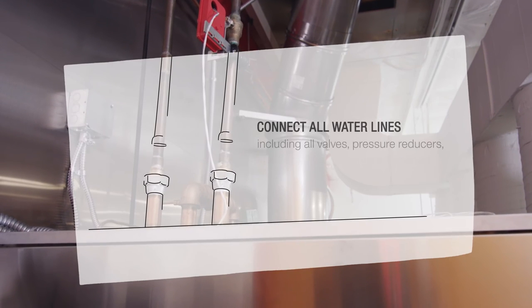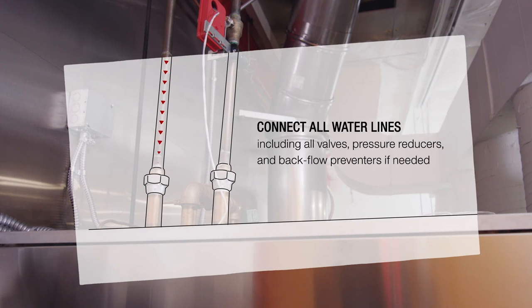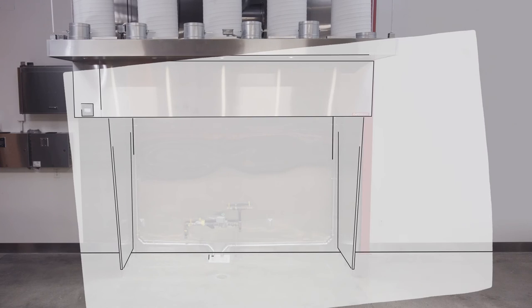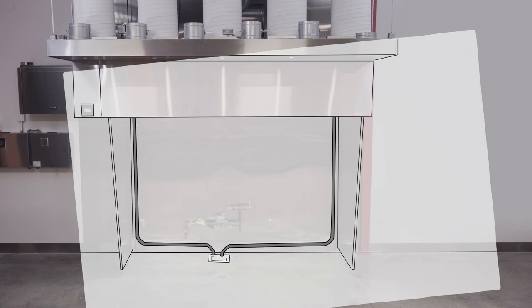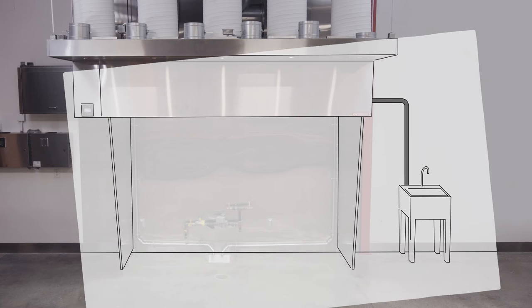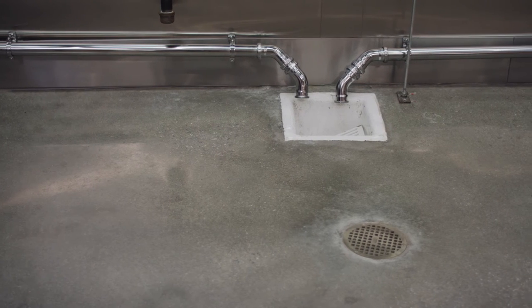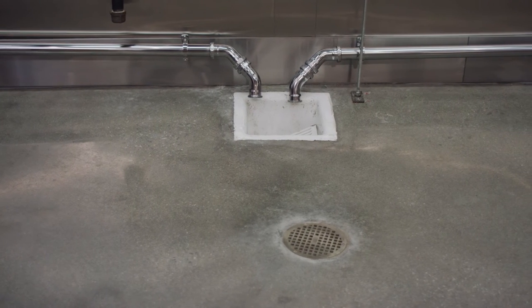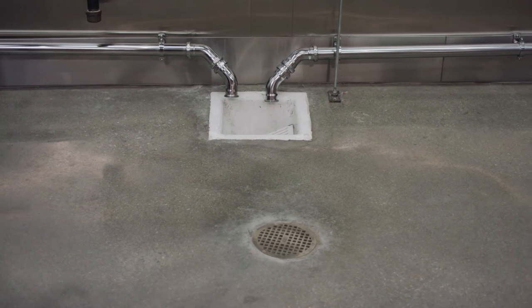Now it's time to connect the hot water and sprinkler lines. Once the water is hooked up, the hot water line must be insulated. The self-cleaning drains can be piped to the floor, a floor sink, a mop sink, or any other line that runs to the building's grease collector. These drains can be piped in copper by the plumbing contractor or piped using a piping kit provided by Captive Air. These drains should never be piped using plastic pipe.